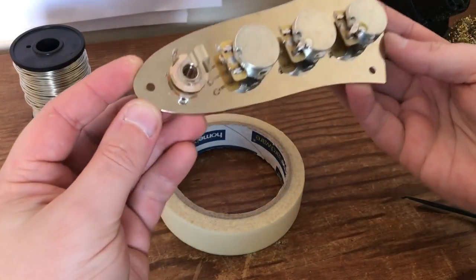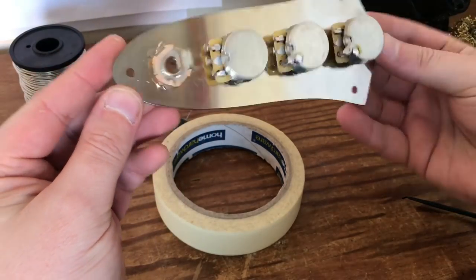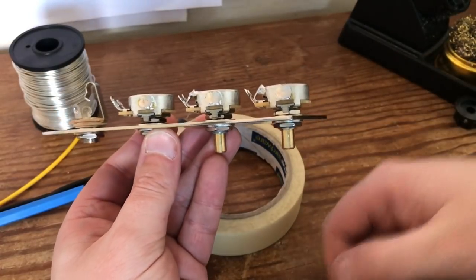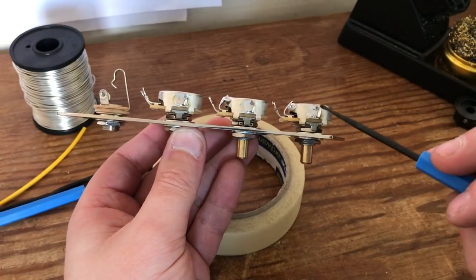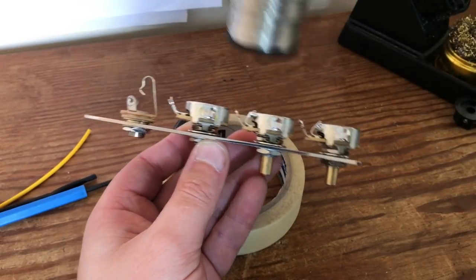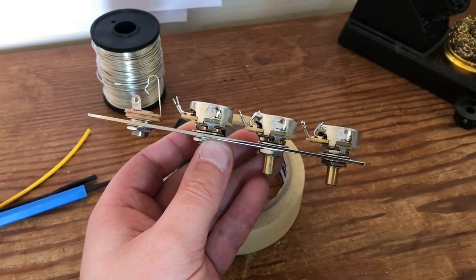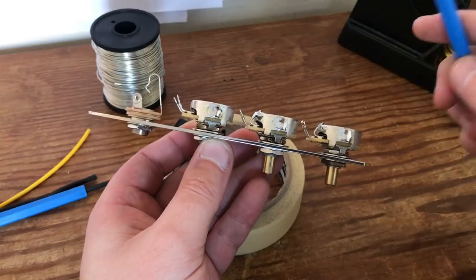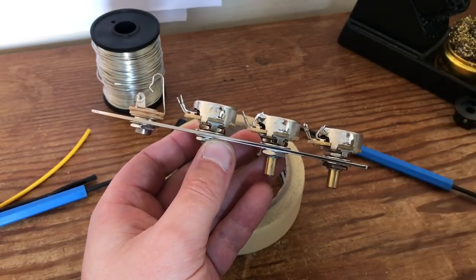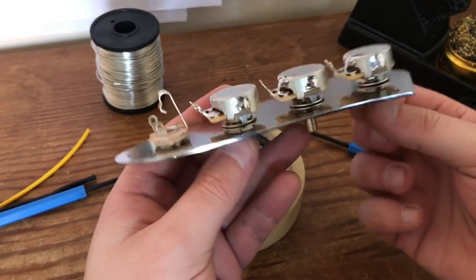8 minutes long, that bit of tinning session, but to be fair, it does make it a lot easier earlier on. A lot of people find it boring, but I definitely recommend it, to be honest. So there you go. As you can see, we've got those three shiny puddles of solder on the side of the pots. So we're gonna lay down a ground wire using tin copper or cloth wire, whatever you prefer. And we're gonna have a wire connecting the three pots together. I'm only going to have the wire connecting the three pots because I'm then going to use a bit of cloth wire connecting that pot to the ground lug there. So when you come back, they'll have a ground wire down, and then we'll actually move on to wiring the rest of the circuit.